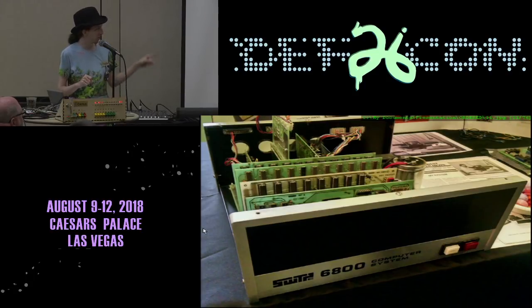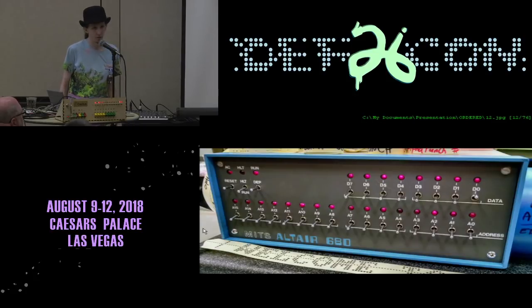The Altair 8800 front panel is amazing — simple, effective, doing front panel DMA, nice and easy for the most part. It's a kit you can buy, start with 256 bytes of RAM. At the same time, Southwest Technical Products comes out with a 6800-based machine — no front panel, assuming you'll use a terminal, which means you can do BASIC. Then MITS comes back and makes their own 6800-based machine: the under-engineered Altair 680. It's got a front panel, but there's not much to it — you have to manually increment your addresses, and it's only got 1K of memory built in.